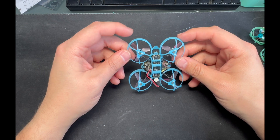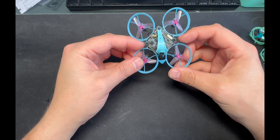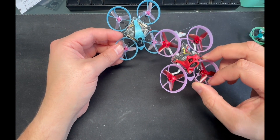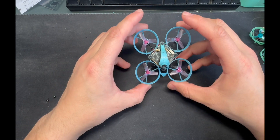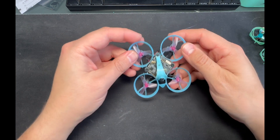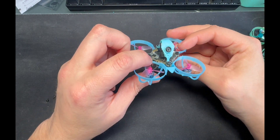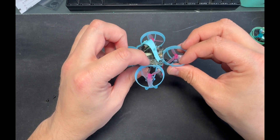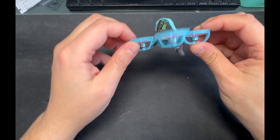I'm an arrow-front guy, but if you want to trim the airframe further you can. I removed the major side braces — I snipped them all down. Normally you'd have extra support there, but I got rid of them to make it more flexible, which actually makes it more durable because it's less rigid and gives a little more on impact. I also got rid of the back brace. I melted and trimmed a little on the sides near the back to shave weight and give room for the VTX.